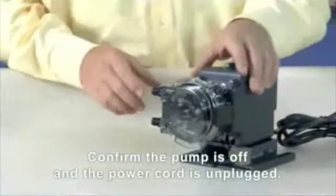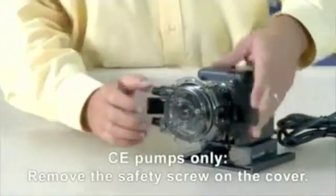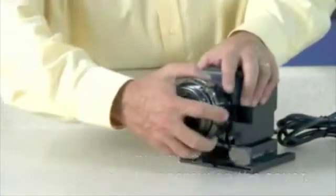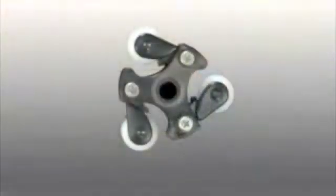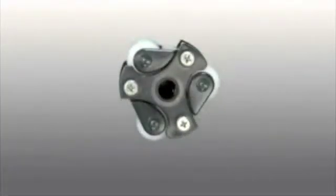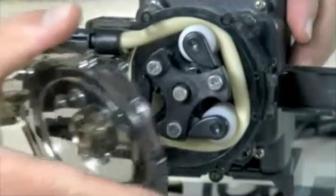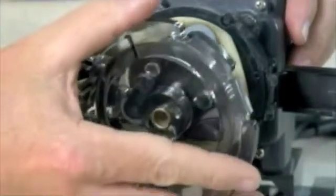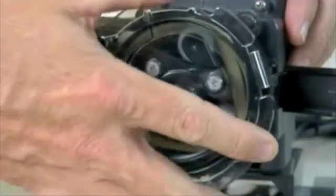Open the front and back latches on both sides of the head. Carefully fold the latches back to prevent contact with the cover. Remove the tube housing cover and flip it to use as a tool to collapse the roller assembly. The roller assembly needs to be collapsed to remove the tube. Align the center of the inverted cover with the center of the roller assembly so that the three holes on the face of the cover align with the three knurled lugs on the roller assembly.